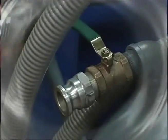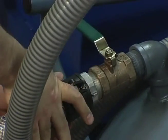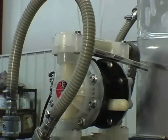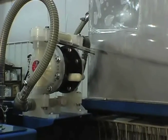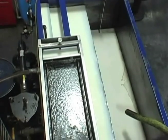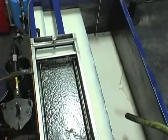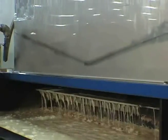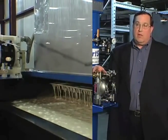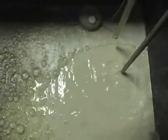The dirty fluid from the machine tools comes to the machine. We take the dirty fluid with that diaphragm pump and process it through the heart of the system, which is the Smart Skim Cross Flow. That helps get the oils quickly out of the coolant, removes the solids, and then it goes back into the system. The coolant flows by gravity into the clean side of the coolant loop system, then overflows continuously back into the dirty side on a continuous loop, providing multi-pass filtration and aerating the coolant.